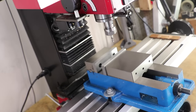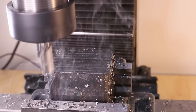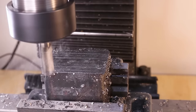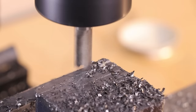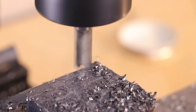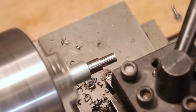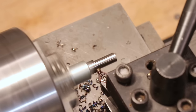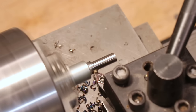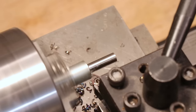Let's talk about milling, or metal work in general. Pretty much any process used to turn or shape metal generates a lot of heat. A good example is on a lathe — you can usually see the heat that builds up in the chips that are thrown right at you, or your hand on the handwheel. If you go by the oxide colours of those chips, the chips are briefly in the high 200 degrees Celsius, and that's pretty hot.